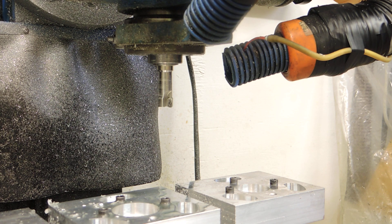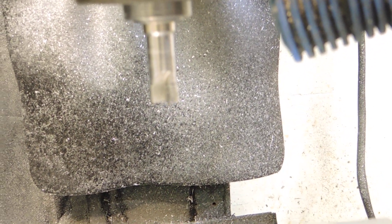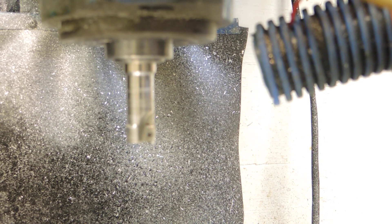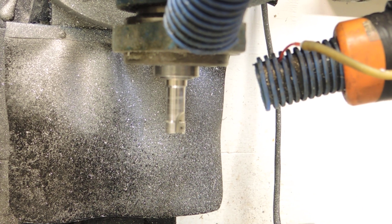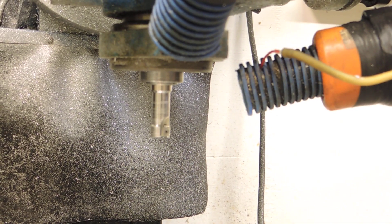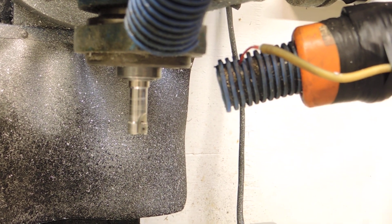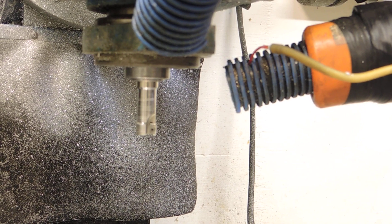The side cuts are not good. There are certain inserts that will probably give you better or good profile cuts. I'll get into that in more detail, but basically each one of these insert holders probably has one insert that will give you a good side cut. All your other ones that have hooks and cups and weird shapes to them don't give you good side cuts. But that's not what I'm doing today — I use them for roughing and then finish out with a high-speed steel or carbide cutter.